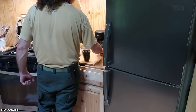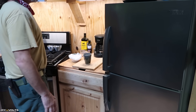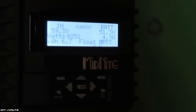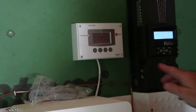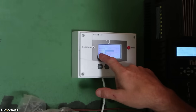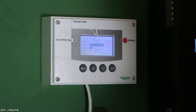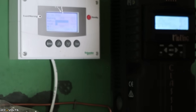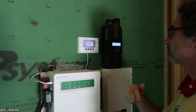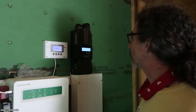He's going to turn on the coffee pot to pull a lot of watts and we should see the turbine pull its full potential on the charge controller. Yeah — 250, 253, 252. This control panel for the inverter shows the battery level and current load — the coffee pot is drawing 690 watts, which is incredible. She's running right at 250 watts. Now the coffee pot is off and it'll jump back up real fast with nothing else running but that fan.